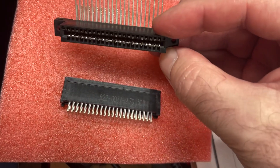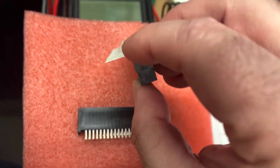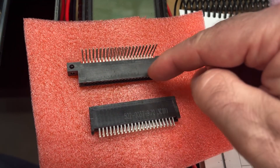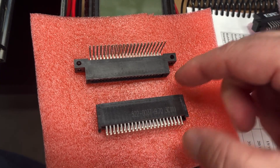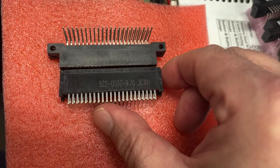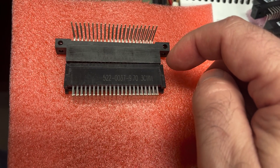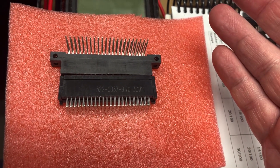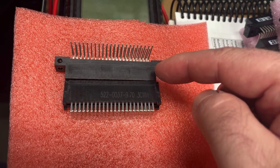They are still the 44 pins — if you look on the edge here, that's all the same. But notice that the pins are exceptionally long, and the most important issue is that they have these flanges on the edges, which means the cartridge can't go all the way on like it can here. This particular cartridge connector is about a millimeter longer, which prevents cartridges like Aquaricart, the 32K RAM cartridge — both from Jay Snellen — and also Turmoil 2068 and some others from going in.